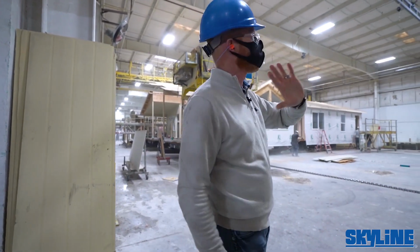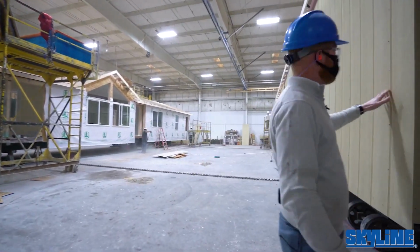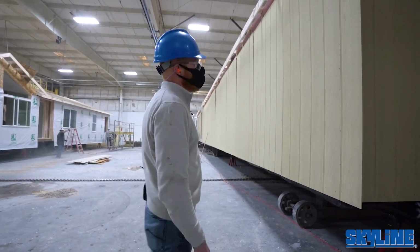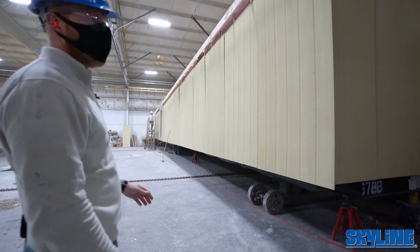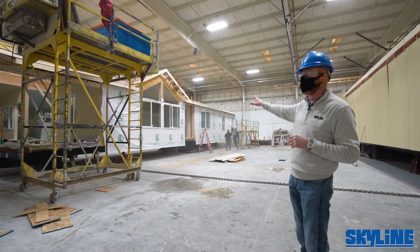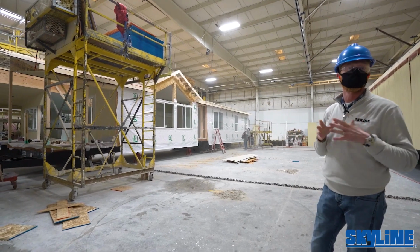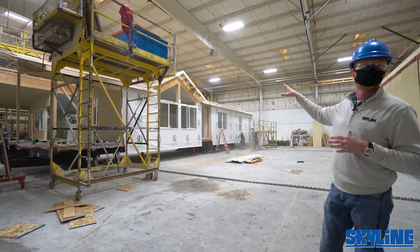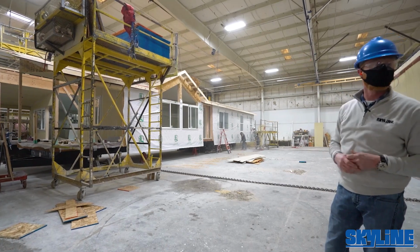cement siding, James Hardie siding. This particular one has sheets of cement siding panels on it, running all the way down. They'll cut out the windows and door frames as they go along. That's also a good vantage point of what we call a sky view dormer. That particular application replaces the standard 10-foot dormer and gives it a 12-foot trapezoid window, and it makes an aesthetic breakup inside and out.